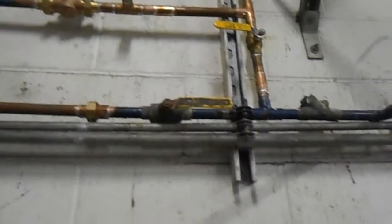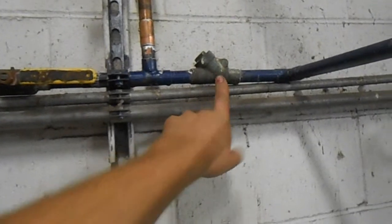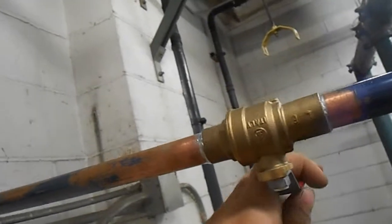After our condenser water issues, we had some trouble refilling the loop and getting the air out of it. Part of the problem was this area had a bunch of bad parts — bad valves and stuff. This check valve being the first thing that's bad. That doesn't really matter now because we have a ball valve over here. This is our city pressure coming in, and this check valve should be isolating the condenser water pressure from the city water pressure.